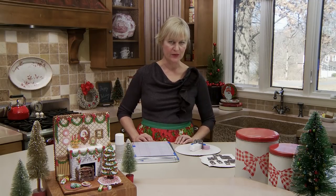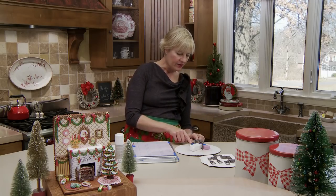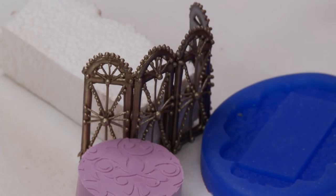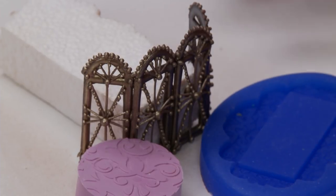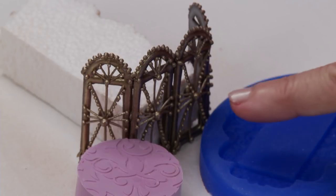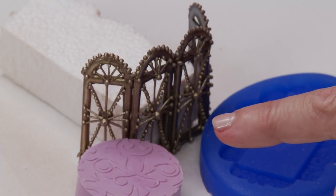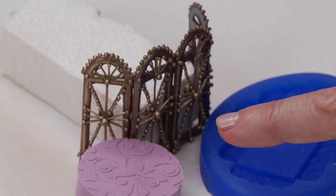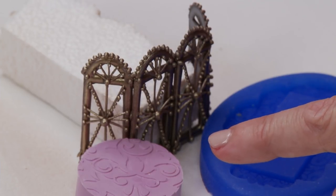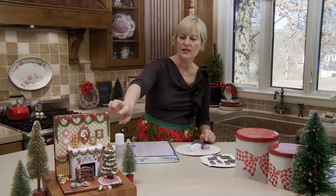On to the fourth element: the fireplace screen. There are a couple of ways to construct it. This piece is comprised of four individually piped screen elements, each about three-quarters inch by one and three-quarters inches tall - I'll have exact dimensions in the video description. All four elements are pieced together to create a screen. On the version in the vignette I have one single bigger piece across the front and two side pieces, so three total elements.